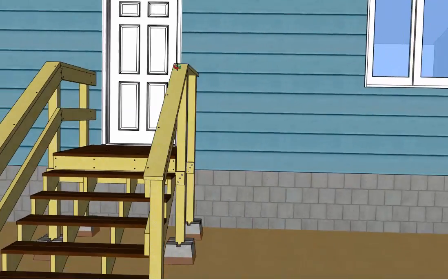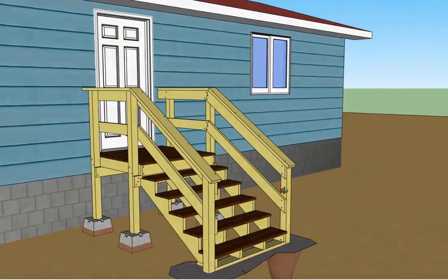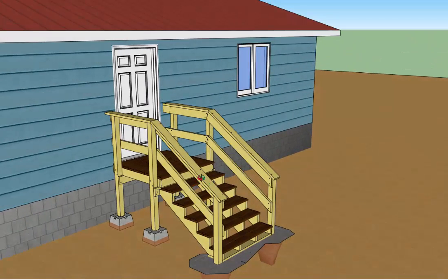Repeat the process to complete the other side of the rail. Make sure you have plenty of fasteners to keep the rail up — all the fasteners on the rail are just three-inch screws. Be careful not to put screws so close to the ends of the wood that it splits. At this intersection you may need to drill some pilot holes. But that's it — you've finished your deck, and hopefully it looks a lot like this one.